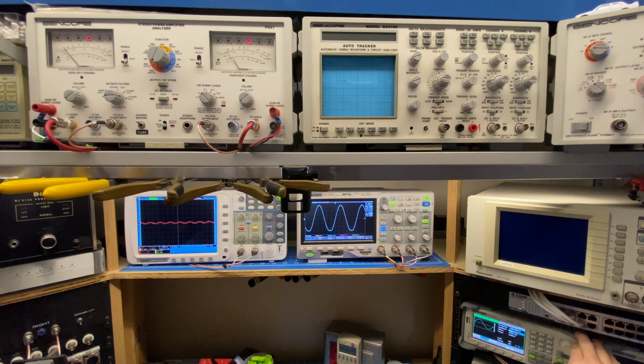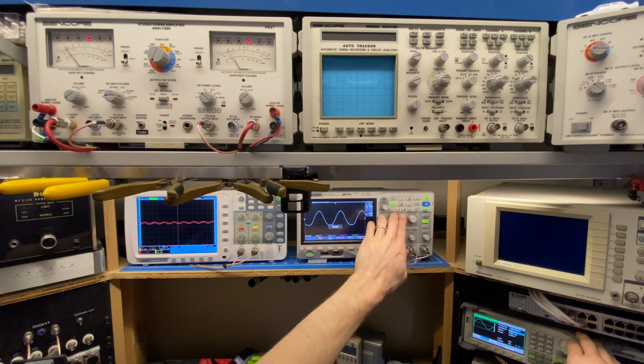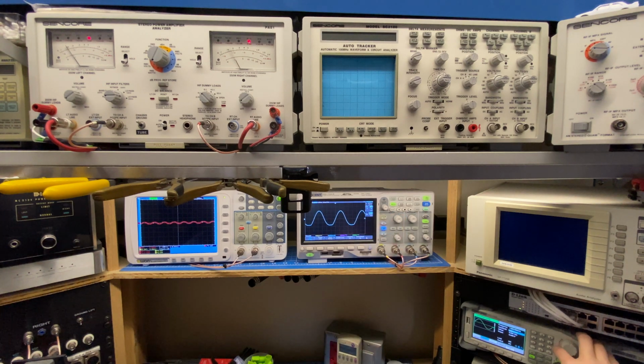I'm starting to get pretty severe clipping down here, but not on the top. I'm wondering if something might not be quite correct there. That's where I'm clean, and that's showing 10 volts RMS into 8 ohms. 10 times 10 is 100, divided by 8. That's only 12.5 watts. That's really low. So I might have an issue there in the mid-range channel.